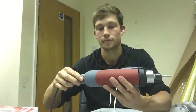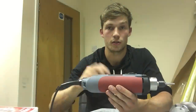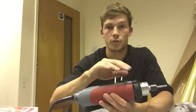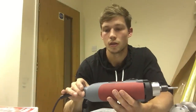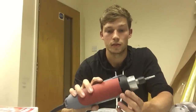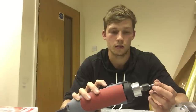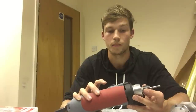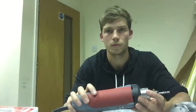You can feel the air coming off it — it's air cooled. There are brushes on this, which stop debris from getting in. I usually use it at around 15,000 RPM at most, and the Chinese spindle was a lot louder than this one. The Kress is just a lot quieter and much nicer to run between 5,000 and 15,000 RPM. Even cutting aluminium, you'd probably want to use it at about 12,000 to 15,000 RPM depending on the tool bit you've got and what cooling you have. Talking to machinists who make some of our moulds, that's kind of the range you want to be at.